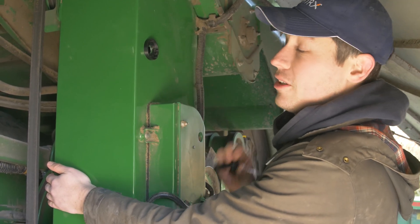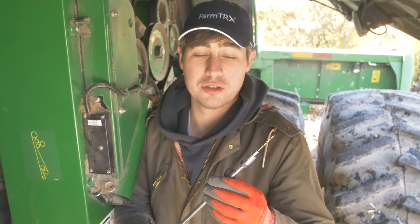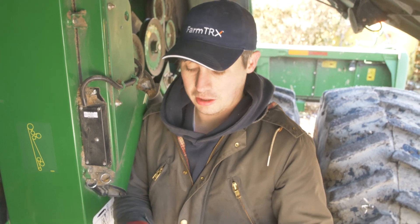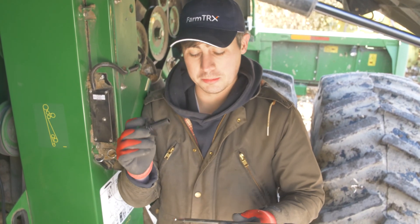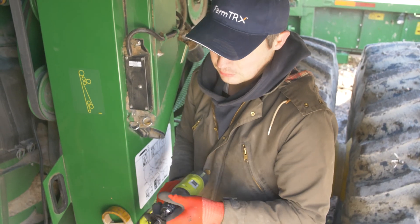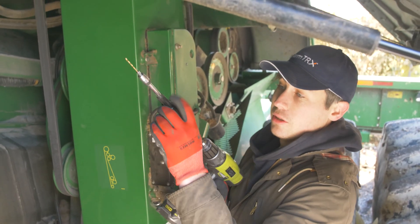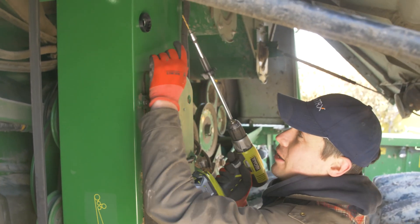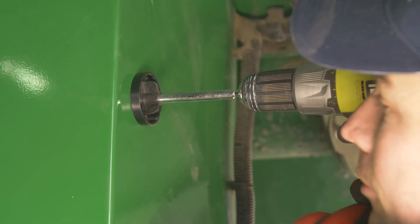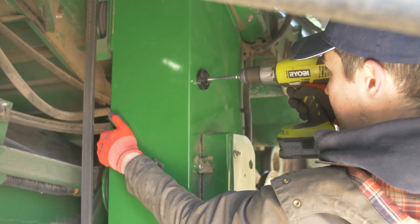But first, we're going to drill the hole in the backside from here. Included in the kit is an extension for your drill so that we can go and drill the backside of the elevator from here — we don't need to drill blindly. Using that same drilling jig we used to align the first mounting plate, place it on the extension, slide it up, and then mount the extension on your drill. Once you're ready and in place, we're going to mount this drilling alignment jig back in the mounting plate. Put the drilling alignment piece back into the mount and lock it into place. You should now have a nice straight shot to the back of the elevator wall — drill the pilot hole.